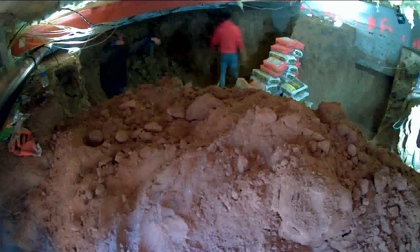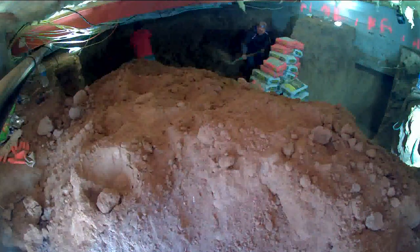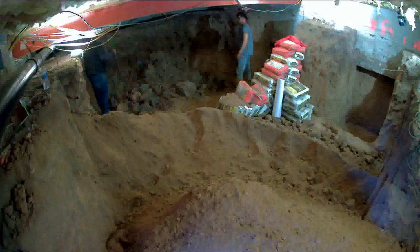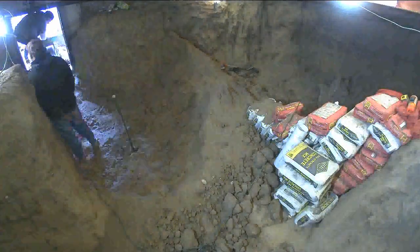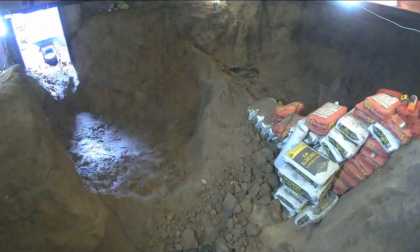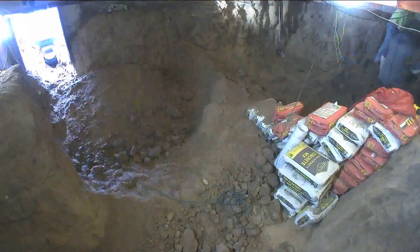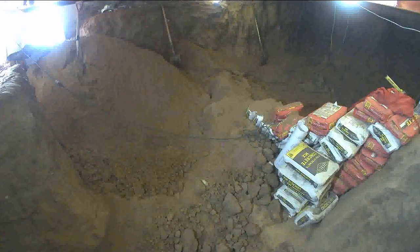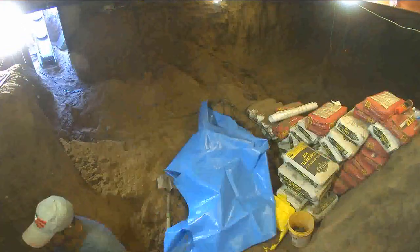All this room allows them to work in stages — right now just clearing all the material out of the basement. Once that pile gets really big, they'll switch over to the entrance and start loading it on the conveyor, with one person outside wheelbarrowing it out to the trailer. We've seen videos on YouTube where people try to do this on their own using buckets, and we do not recommend that method. If you're thinking about doing this, conveyors are probably the easiest and most intuitive option — they free up a lot of the work you'd otherwise have to do manually.